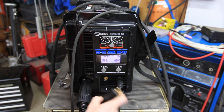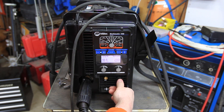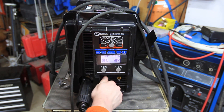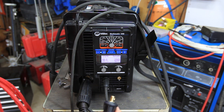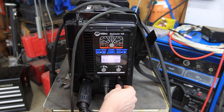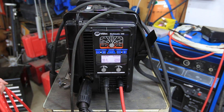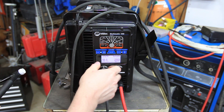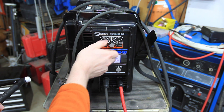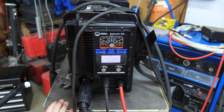What we got to do here is disconnect our MIG cable, then we need to move our ground over here to the positive electrode — since with TIG you run DC electrode negative. Now we just take this, plug it into our negative port here, and then go up to our process selector and switch it to lift arc.